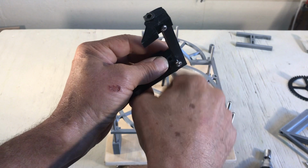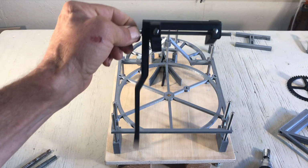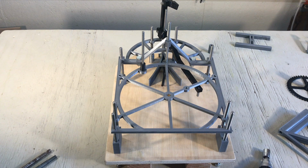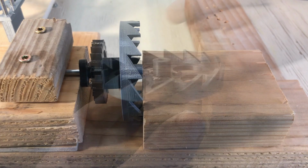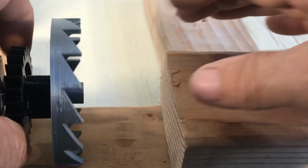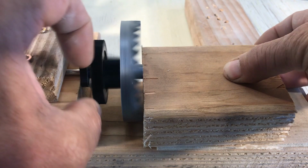The escapement, there's those pallets that come screwed on. Make sure it swings free on the shaft. That's to hook up the pendulum. Notice the warp on the escape wheel. So I made this jig to set it up better.